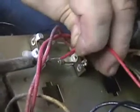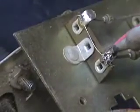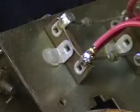We're going to heat up the connection for the bridge rectifier — the positive side. How do you identify the positive side? On the diode there's a little band on one side, and this is the side where the two bands face each other. Don't put this on the wrong side or you won't pass the smoke test. We've got the leads in here, soldering them on the positive side. This is the 12-inch red going to the positive side of the capacitor — that's your plus 36 volts.